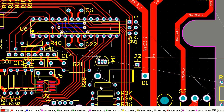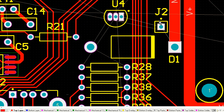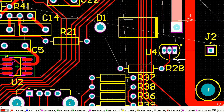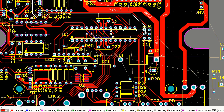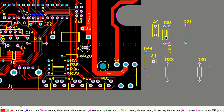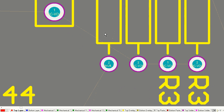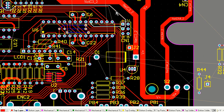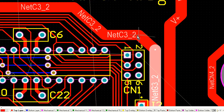I mean, this is not a high-speed controlled impedance board, so cutting up the ground plane isn't really a big deal here. But if I'm laying out a much more critical board, then those little aspects of saving a couple of millimeters of trace length, just so you can get a slightly bigger ground plane on the bottom, can be very important in high-speed designs, maybe for EMC compliance as well. The ground plane's a big thing, and you want to chop that up as little as possible.